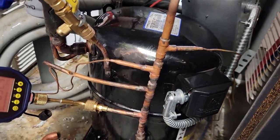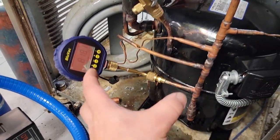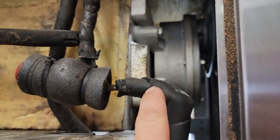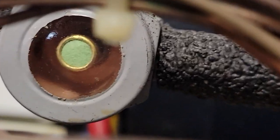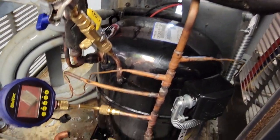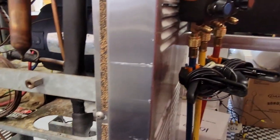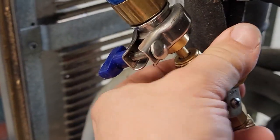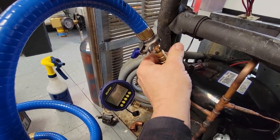I'm going to get started on the electrical over there. This lead is kind of short so I may have to mount it over here, which will make it easier to work on in the future and keep it out of any drippage from the rear of the barrel. We do have a sight glass which you can see is already pretty green — it was starting to get a little yellow from being open for a while. At five minutes we are at 700 microns — not bad pulling with only one hose. We're kind of stalling out at 20 minutes but we've been under 500 for a while. Let's get that air bubble out from underneath that ball and see if this thing will hold.